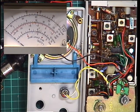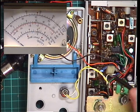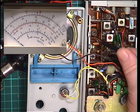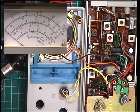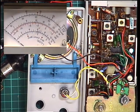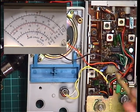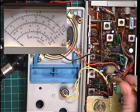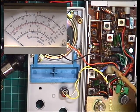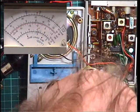So it was T3, T3, T4, L-something — I can't tell — L2 and L5 that were adjusted. I don't think that last one is supposed to be adjustable — it's just a core. Because it's an emergency kit, it doesn't have high-low power. It doesn't have an S-meter, but it does have deviation. There are two presets: RV1, which is down there just under the foam rubbery bit where the PTT is, and then there's another preset down there somewhere.